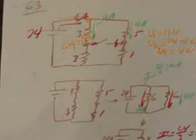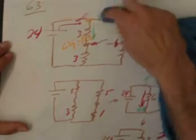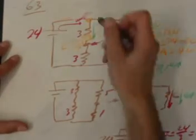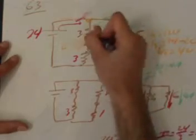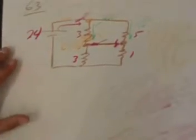The circuit changes when the switch is closed. The 8-amp total and the 4-amp branch currents no longer apply, and the voltage drops will change. When the switch is closed, there's now a straight path connecting A and B. The resistance values remain the same — 24 volts is still the supply — but the circuit topology is now fundamentally different.